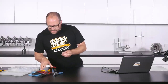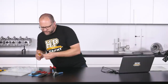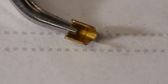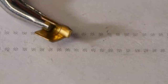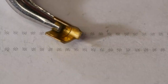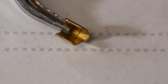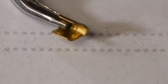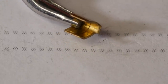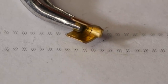So for that reason when I'm building a club level harness, I like to use brass open barrel splices. They're made out of brass, which is quite important. Brass is an alloy of copper and zinc — the brass used for these open barrel splices is around about 65% copper and 35% zinc — and that actually means they're really quite stiff. When we're crimping this splice with copper conductor strands through it, because it's brass and quite stiff, it's actually going to retain its shape through the life of the harness and keep pressure on those wires, keeping everything really nice and tight.